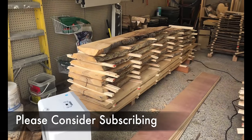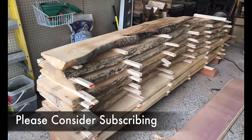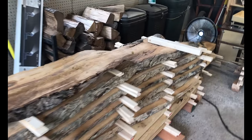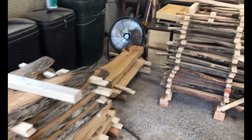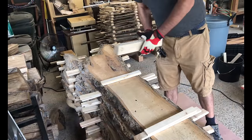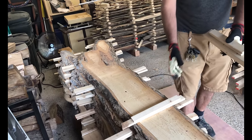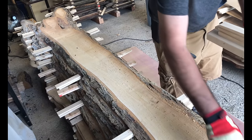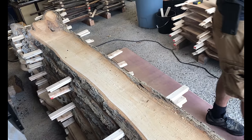You can see that I take my chances with the top board. If I wanted to minimize warping in the top board, I could add a top layer of plywood weighted down with cinder blocks to help prevent movement. I then close the garage doors and leave it with a dehumidifier and three fans blowing to maximize airflow and facilitate the drying. It is also good practice to flip the wood every seven to ten days to help minimize warping as well.